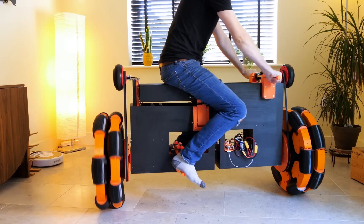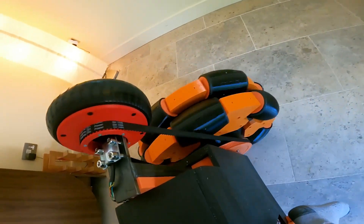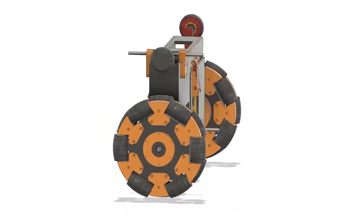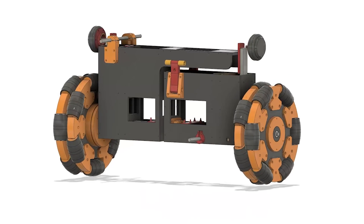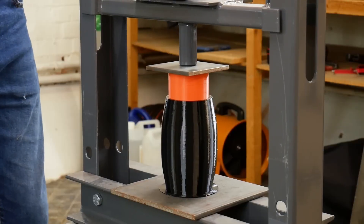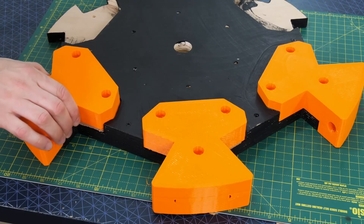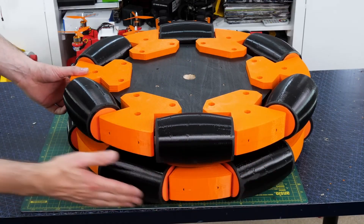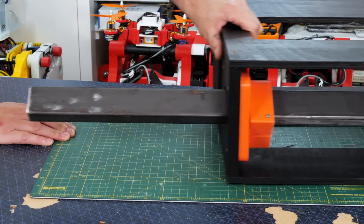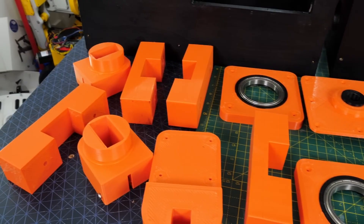Time for more projects. What happens if you try and ride a hoverboard like it was a bicycle? That's the question that James Burton is trying to answer by building this Omni wheel bicycle. The first step is to create these massive Omni wheels. The smaller wheels are made of a two-part 3D print of flexible TPU and rigid plastic. The hubs are then made from CNC cut plywood and some 3D printed parts. The bicycle frame is also made from plywood with some specific 3D printed moving parts. These parts are oversized and pretty chunky, and he's printed them using a 1.2 millimeter nozzle.